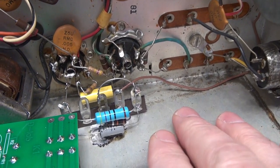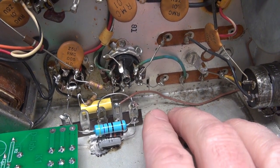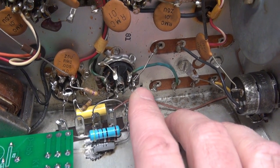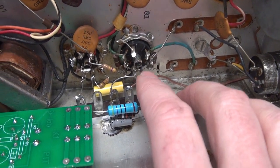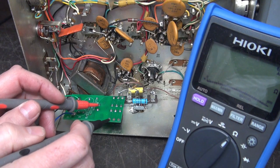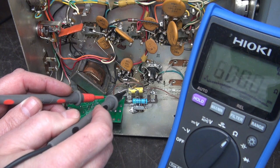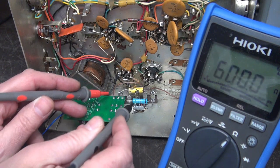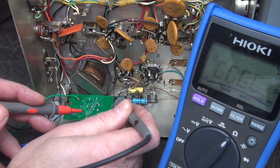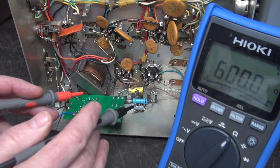You'll notice my radio has an additional terminal strip here — this is the cathode resistor and cap for the audio output tube, which I installed earlier. I have this ground loop that I'm going to lift to break the cathode connection to the output tube, then route that and the sensitivity control over to the K1 board. I have one half of the relay contacts hooked up on the K1 board. What that's doing is grounding the cathode resistor and the low side of the sensitivity pot. This wire is ground; this is our switched line across the normally closed contacts of that relay. When it keys, this contact opens, raising the ground on the cathode and putting 10k resistance in line with the sensitivity control, which mutes the receiver.